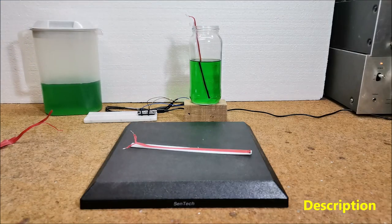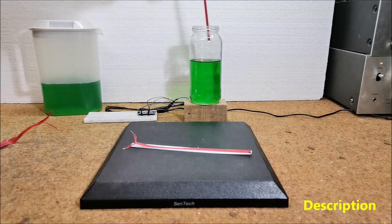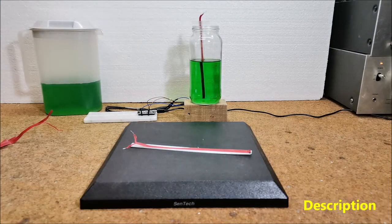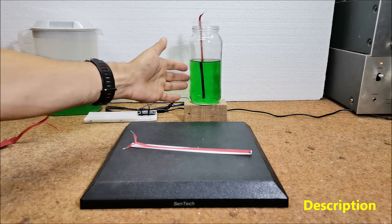As for the Arduino, in this case we use the capacitor library, with the help of which we can measure capacitance with no external hardware; it requires only one digital and one analog pin. We now register the values of the capacity of an empty and a fully filled container. Next we map these values with the amount of liquid that the container holds. In my case it is 500 milliliters.